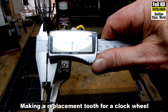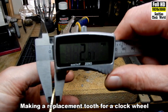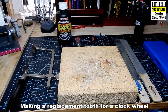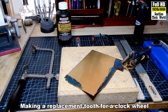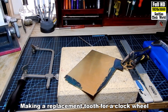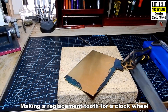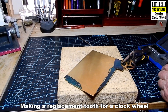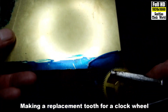The thickness of the wheel is 1.1 mil. The thickness of the brass plate is 1.69 mil. It always needs to be a little bit thicker, so that we can file it down and finish it off when we've done the teeth. Right, let's remove a lot of this stuff out of the road first — 1.11 mil. It's quite incredible, but it's a good one.